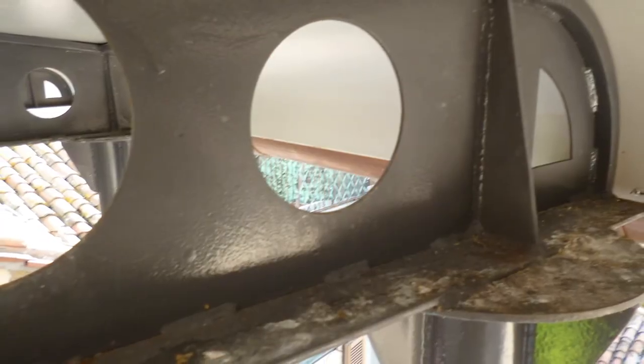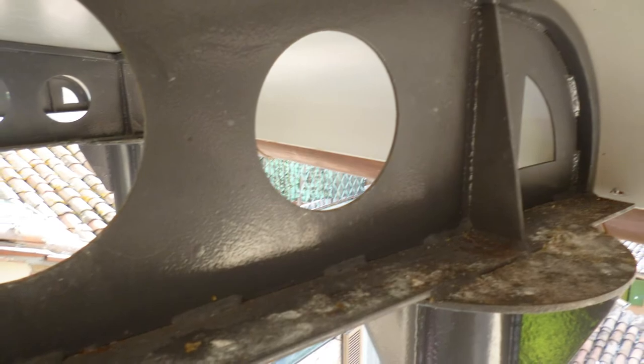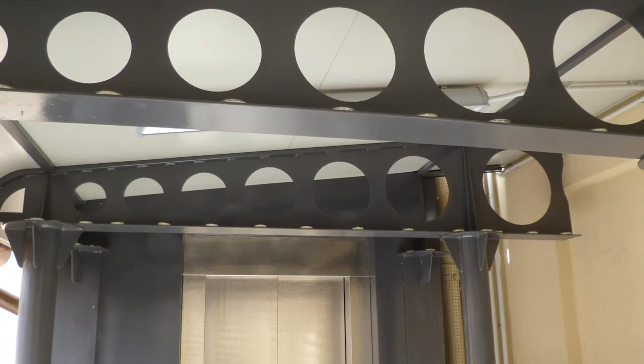Pigeons had been night roosting on the flanges of these beams and fouling the floor below. The flanges were disinfected and treated with dishes of Bird Free at 20 centimetre centres.